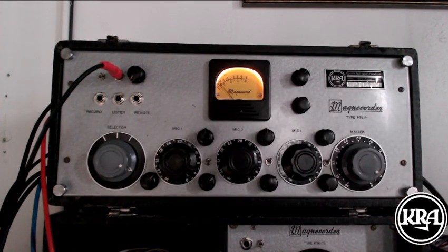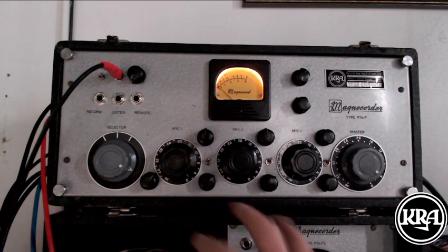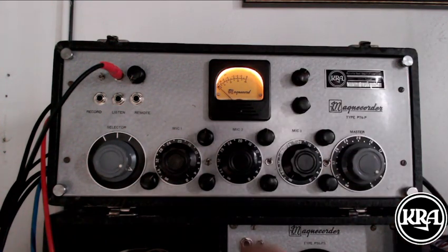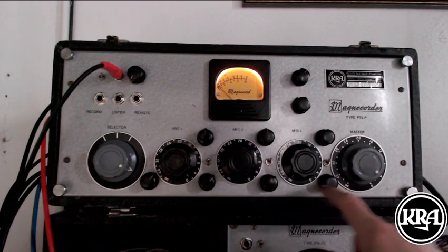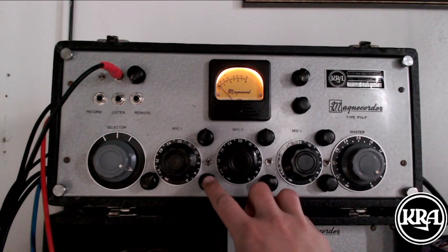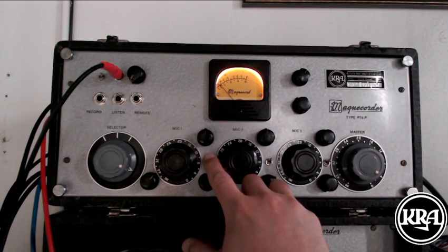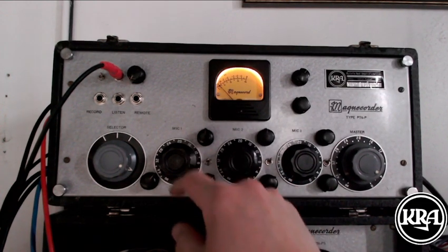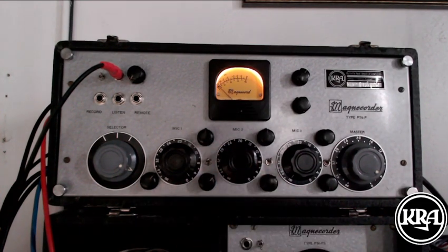All right, so then what else, right? That might have been where I left off the last video update, but I've added an effects send. Each channel has a send level and a pre and post switch. So I believe up is the post fader position and down is the pre fader position.